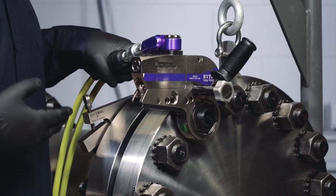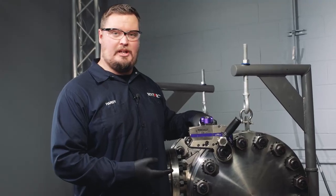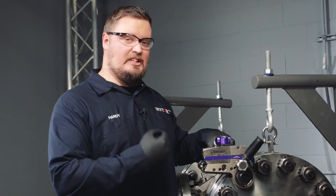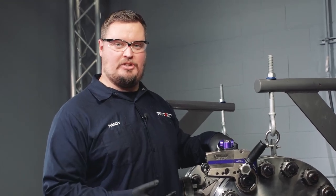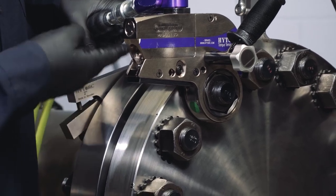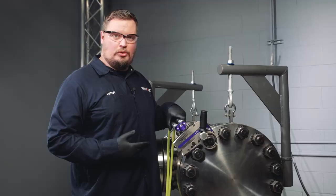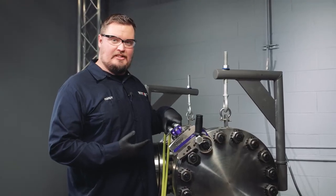In this scenario, we're using a stealth tool. On the stealth tool, your reaction force is going to be against your opposing nut. Whether it's in tighten or loosen mode, it'll always be against the opposing area. On this application, this is the main pinch point area. While operating this tool, always keep your hands in safe areas.